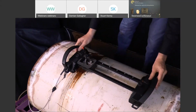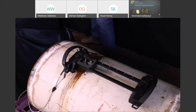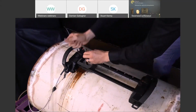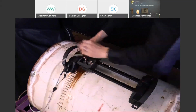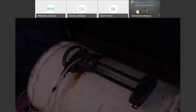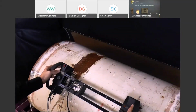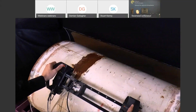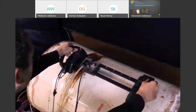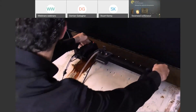So that's locked in place nicely. Just pop the water in. Okay. So we've got the water on and we're ready to scan. The main difference between the Lynx WI and the Lynx CM is the button operation. When in this mode, the button actually acts as a stitching function, and will index step, as we'll see in the C-scan. So we progress forward.